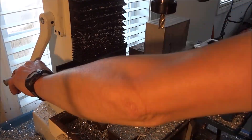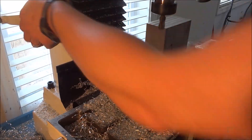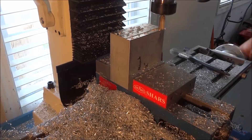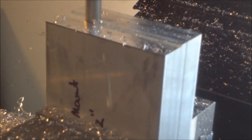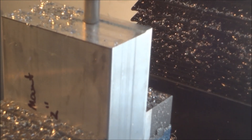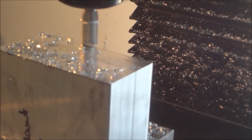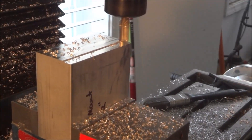You can see me here measuring it and now I'm getting it to the final dimension here on the mill. I'm pretty impressed with the Precision Matthews so far. I've done quite a bit of manual machining and it seems to be working fine — I did blow a fuse at one point, but other than that I haven't had any issues. You can see here I'm running at about 600 RPM and I'm taking a pretty aggressive cut, about 60 to 80 thousandths and almost a full half-inch width. It does a really good job.